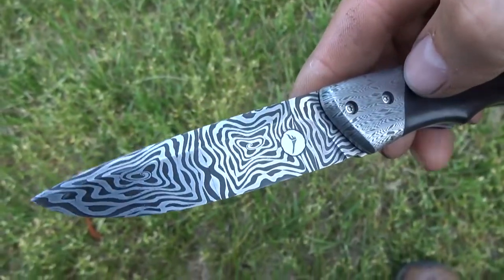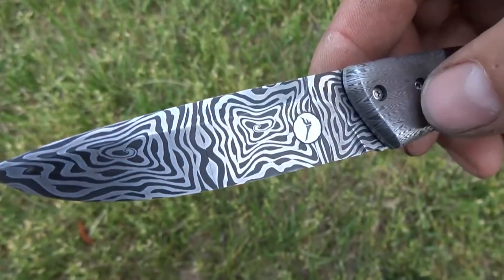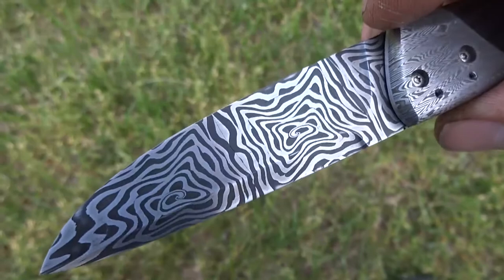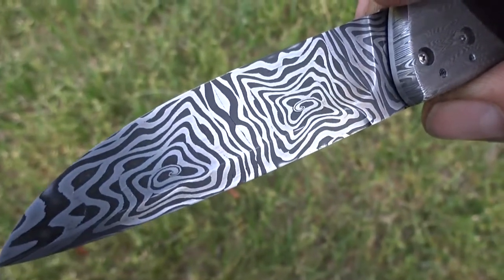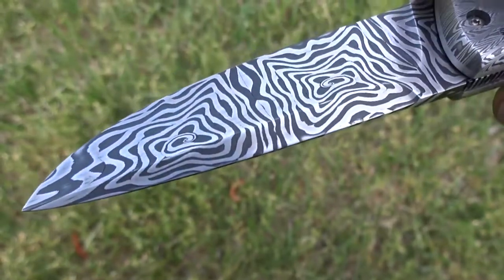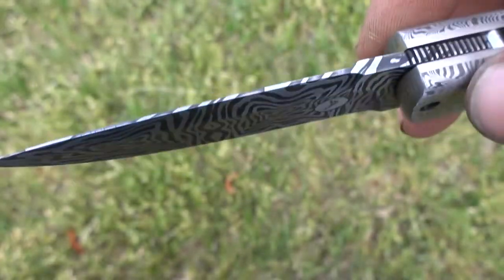The blade is jelly roll but in my own modification which I call rose rolls — basically laddering a bar first, a very coarse bar to give it squiggle, and then rolling it up. So that's a tiled-out mosaic pattern — three tiles for this little blade.